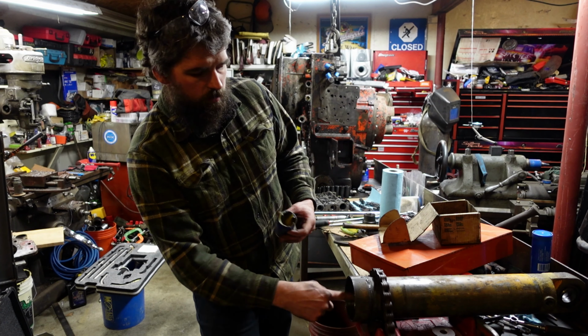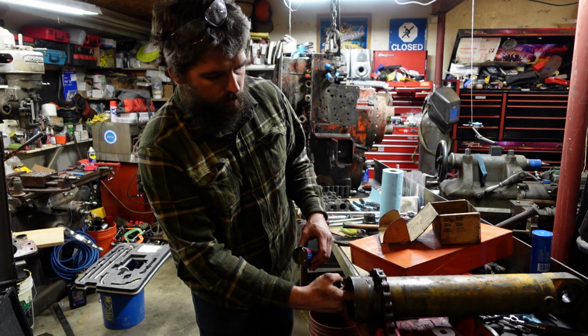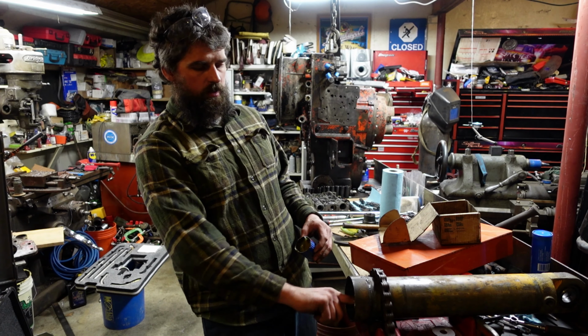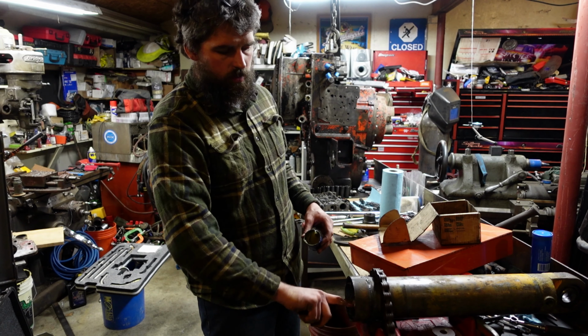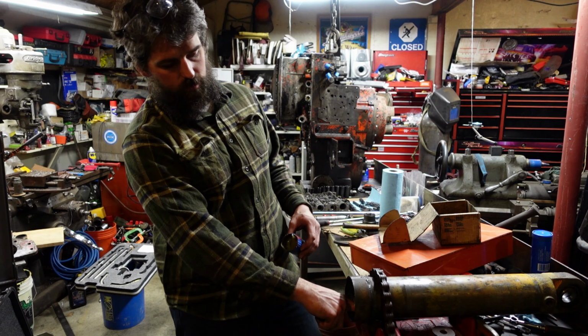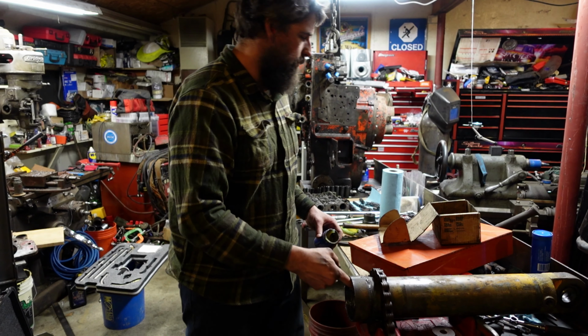And I really want to get some grease up right where that O-ring steps up onto that bore we just cut. I did relieve the edge a little bit and polished it, but I want to give it every advantage I can because I don't want to have a cut O-ring and have to open it back up. So we're going to lube up the edges.